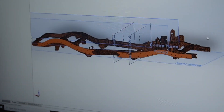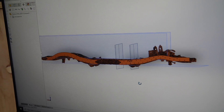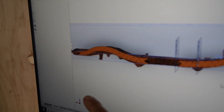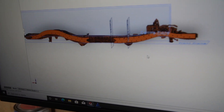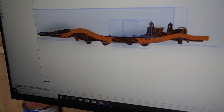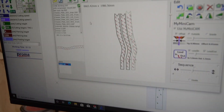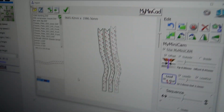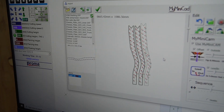Let's show you how this plasma table works with some test pieces, and then we'll get into future modifications and plans for the table. You can see here Laurie's actually been busy on CAD — I've given him a few lessons and he's designed up these chassis plates, raising the back of them so we can get some more up-travel. This is one of the first things we're cutting with our plasma table. You export as a DXF, and then go over to the MyPlasma CNC software where we're nesting them up, checking all the settings, avoiding material wastage, and adjusting lead-ins and lead-outs before we get cutting.